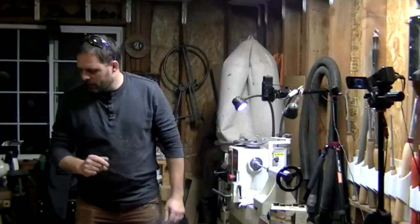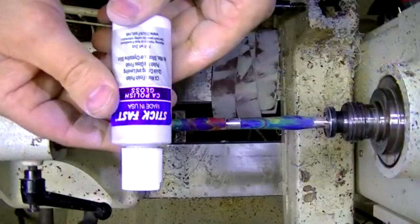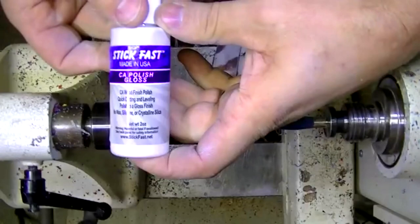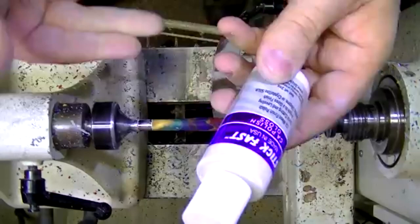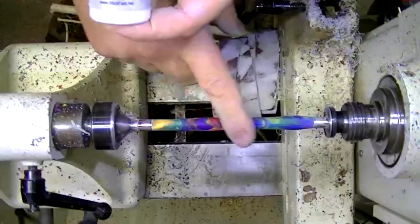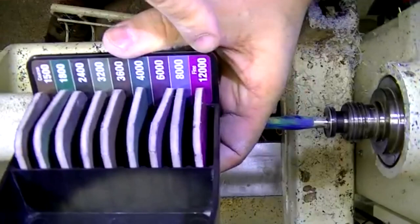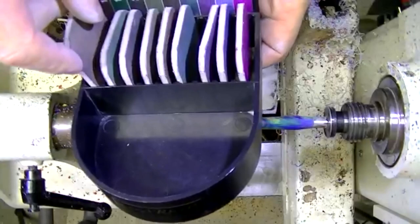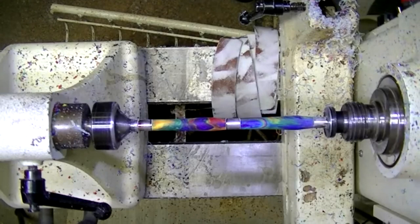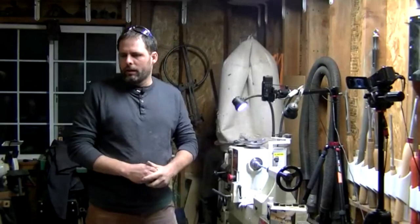So we've got a choice for finishing this acrylic. We have a shortcut — DA Polish gloss. They usually tell you to go to around 600 grit and then use this, which is like a really high-grit paste. Or, if you have the time, I personally like to go through the micro-mesh pads starting at 1500 grit working up to 12,000. I typically wet sand with these — lay something down to protect the lathe, get a little cup of water, dip the pad in. It's only 7 o'clock so let's do the high grit pads — I'll make it as quick as I can.